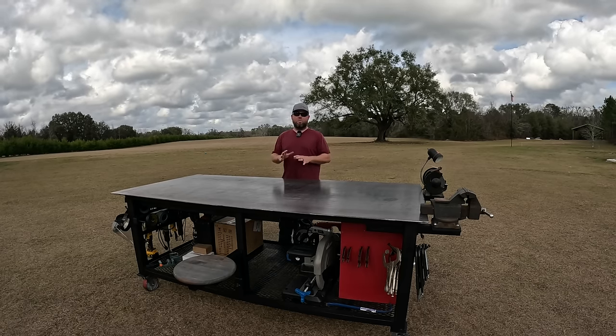Hey, y'all may have caught on that I welded in 2-inch receiver tubes all around this table for all these additional add-ons. See one of them down here on the other end that's welded in, so we can change out parts. But I welded in 2 down here so I can put this table in. The problem is none of this steel is perfectly straight. All the 2x2 stuff that I'm about to pull out, it's got bows in it all different directions. And if I weld the top to both pieces, I couldn't get it to pull in or out. I could have come up with a different design, but I wanted to keep it simple with those receiver hitches.